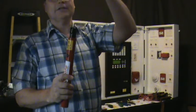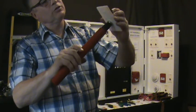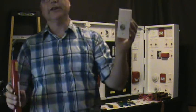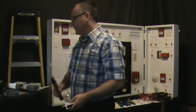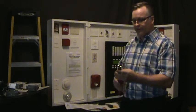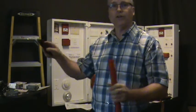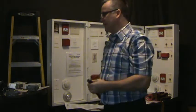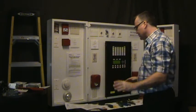And now, if this is at the ceiling, let's just put it down so you can see it. You're just going to put your key into here with your solo pole, click, click, click, do your test, pull it back out. Okay? No ladders required. You got the perfect tool right here. All you have to do is insert the key and tighten it down, you're good to go. So you can walk around with your pole, so this thing could come out, and you could have this as your tool. Click, click, click, turn on all the ones at the ground level. Anything up high, stick it in your pole, go up high, turn it, done, and carry on. Inspection done, huge. It's huge as how much time you can save on this.